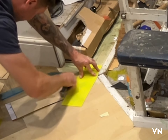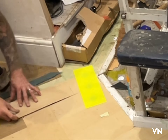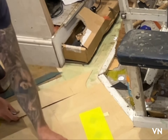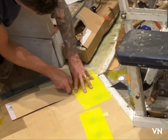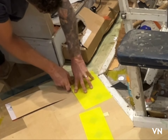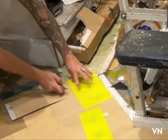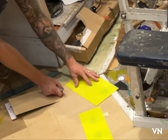Now you just drop it back in the board normally and use your standard cuts to meet up where they go across. Sometimes I'll always do a little pencil line further past where I cut so you don't get that over-cut — you know, when you cut it you don't cut past it.